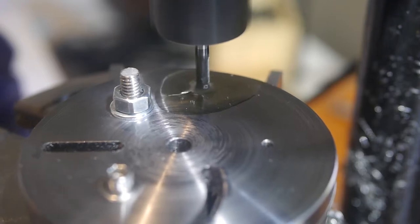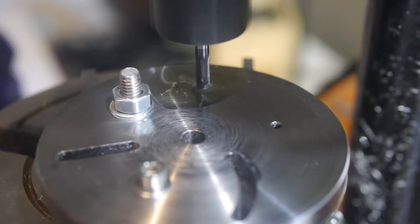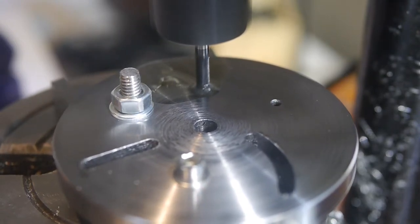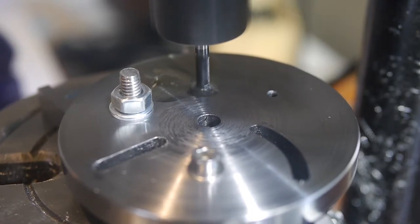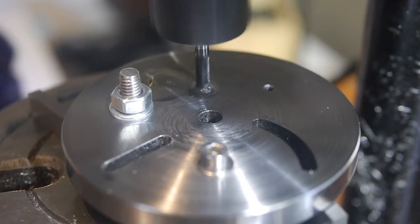After all the mistakes of the previous episode, I was a lot more careful with my measurements, notes and calculations this time. As before, I indicated the vertical slot as a reference, aligned the table at that angle and aligned the cutter at the corrected distance vertically below the hole defining the centre of curvature. I then took the corrected angles of rotation that I noted down in the previous episode to determine the endpoints of the cut on the rotary table scale.